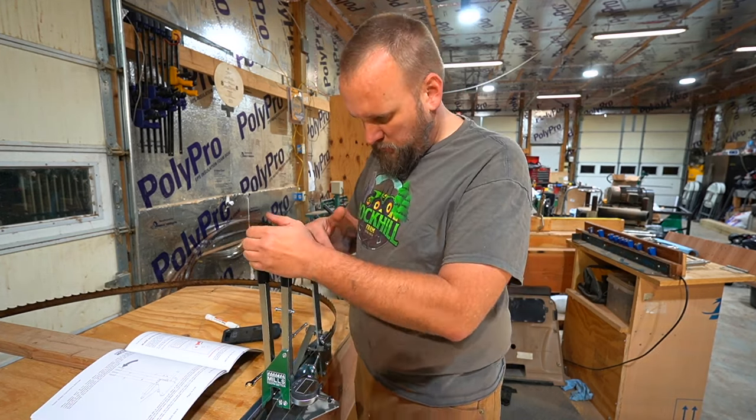So we're about 2 inches above the blade. Now the target is to adjust this down until it's just almost touching. So now this is advancing to the point, as this gets low enough, it's going to hit the advancer, which pushes the teeth. So we need to back this off until that's not an issue. Pushes it forward, still pushing it way too far forward. So we'll just keep backing this off until it's not.